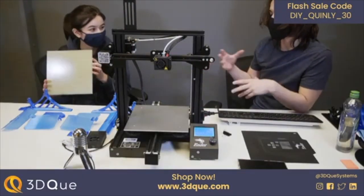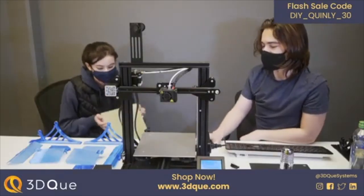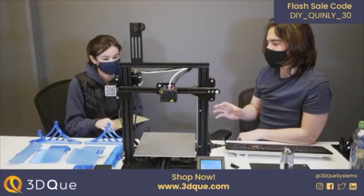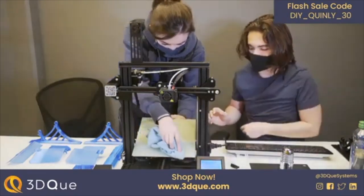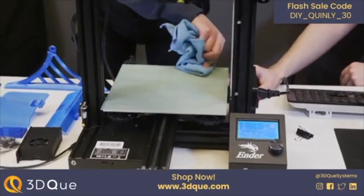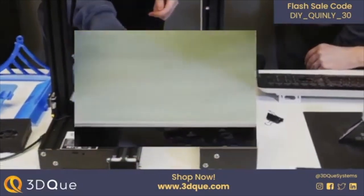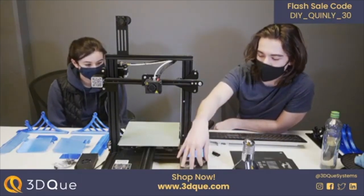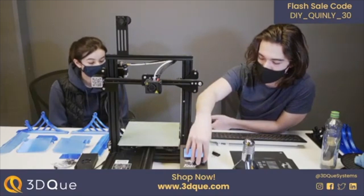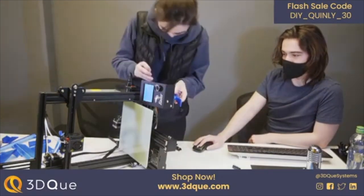There's also the classic favorite — the bed. The main idea behind this bed is consistent performance, so you can print big and small parts without worrying about adjusting settings. This is considered the most difficult step, but out of all our customers, no one has ever had an issue applying the bed. I'll spend maybe an hour to an hour and a half making sure it's perfectly calibrated, and I've run it for two weeks non-stop. Once it's applied, turn the heat up to 80 — that lets the adhesive set really well against the aluminum.